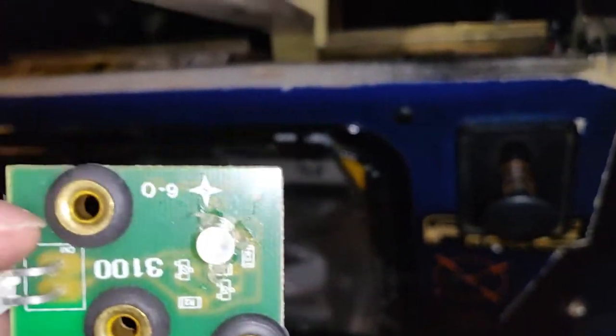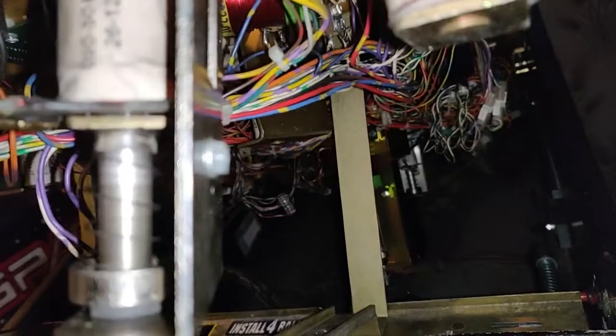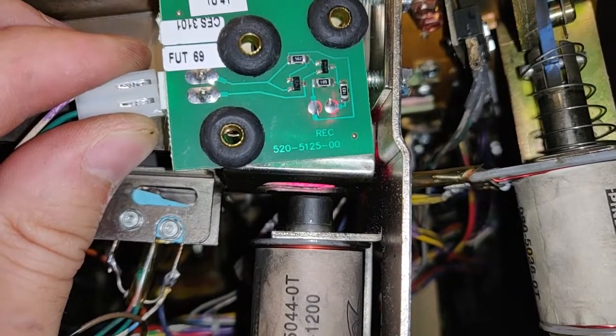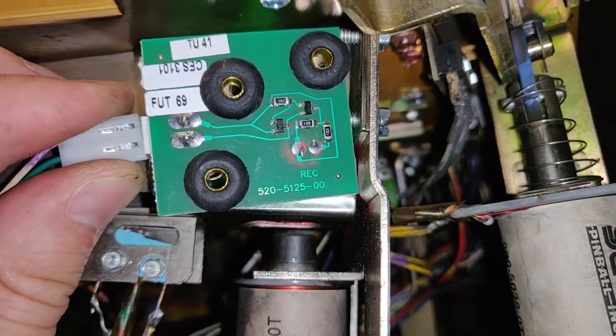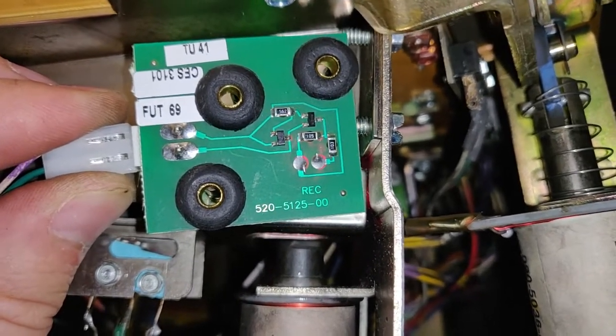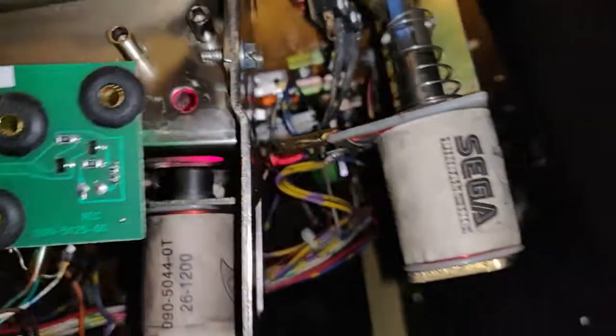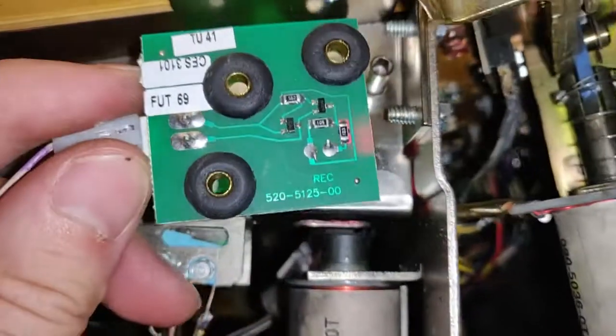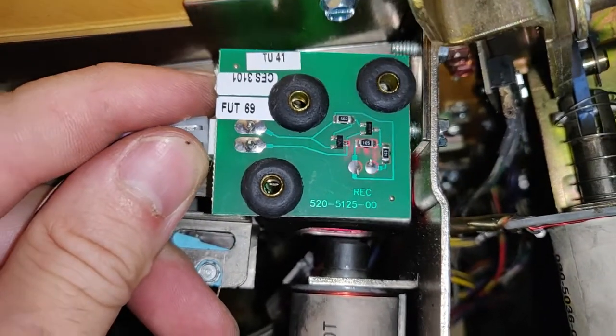And obviously we know we can trigger it from the light on the phone. However, when we place it in place, let's just get this, so we can see, look, we've got the red patch showing through the PCB, so we know we've got perfect alignment with the sensor, but it's not triggering. So the fact that I can trigger it with white light but not with that red light makes me think it's not sensitive enough, or it's not the right emitter, not the right collector.